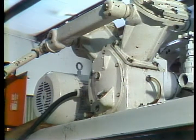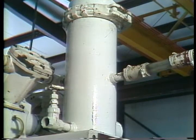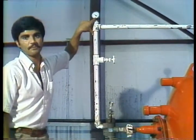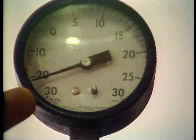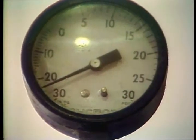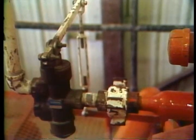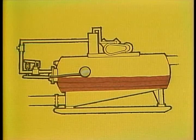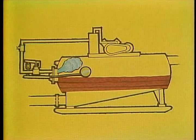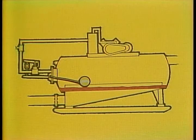This float ball keeps the mud level in the degasser from getting too high. The vacuum pump and three-horsepower explosion-proof motor sit on top of the degasser. Next to that sits a water trap which removes moisture from the gas line. This gauge tells you how much vacuum the pump is creating — to check, you close this one-inch valve which isolates the pump from the vessel. If the pump is operating properly it should read 25 to 28 inches of vacuum. This three-way valve controls the amount of fluid in the tank. If the fluid gets too high, the float ball raises up and opens the three-way valve, letting air into the tank. The air reduces the vacuum and allows less mud to enter the vessel. When the float valve settles back to its original position, it closes the valve and recreates the vacuum in the tank.